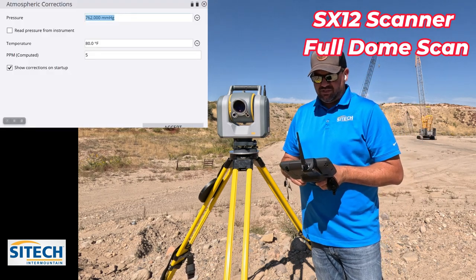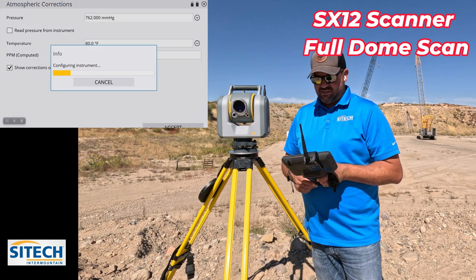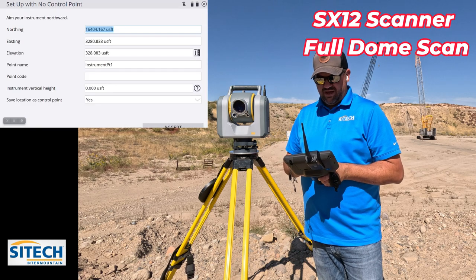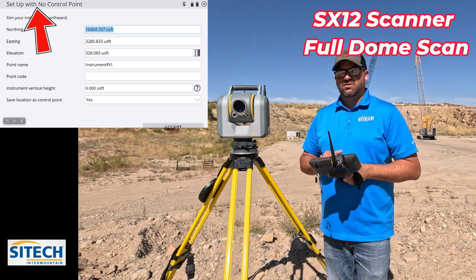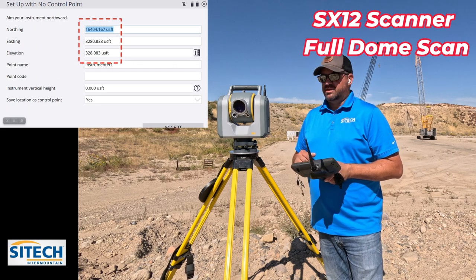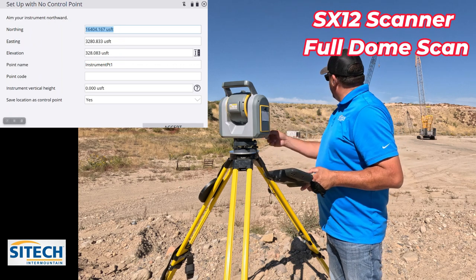We'll come out and we'll actually set it up just like we would in the other one. Okay, so out here we're about 80 degrees. We'll hit accept. Come in here, chain, we'll go right past that. Now, the reason why it says set up with no control point is, remember, I don't have a job site that has northing eastings and a known calibration or any of that to it. It just has no idea where it's at. So I'm going to go ahead and face it north just so it has a general idea.